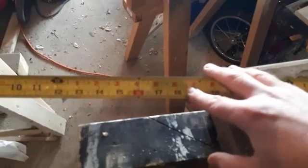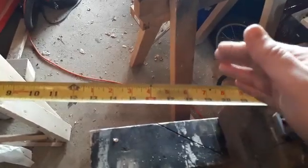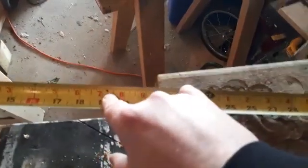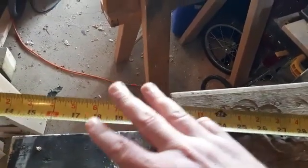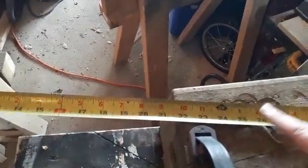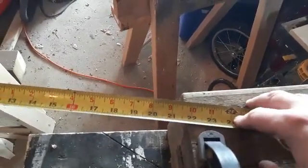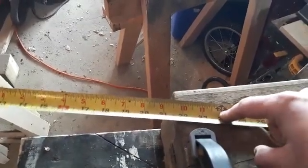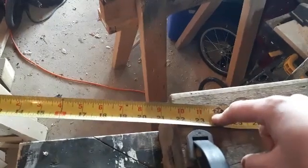So you put in the studs at 16 inches, and then you put your sheeting on the studs, and it helps to eliminate a lot of cutting. This is kind of the same idea. This is the 19-inch center stud spacing, because there's 3 stud or joist spacing. There's 16, there's the 19, and then there's 2 foot. 2 foot you don't see quite as much in studs. You'll see it more on a garage or a shed though, or you'll see it on truss spacing. So trusses and rafters in your roof, that's where you go the 2 foot centers.